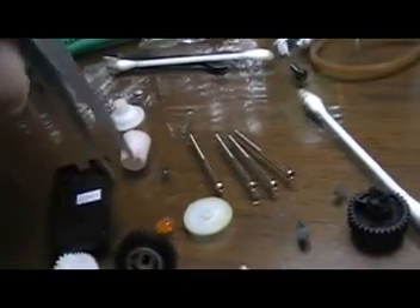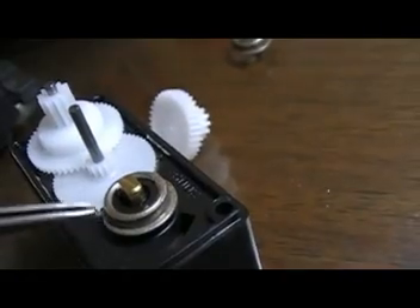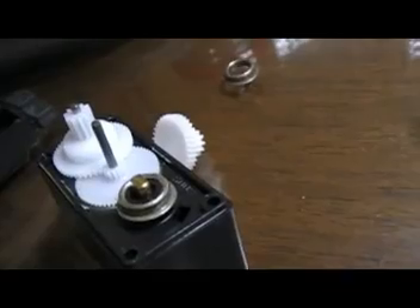Finally I was able to replace the gear. I love repairing servos — it's like repairing a watch. Make sure you put a little grease on the bushing here, and also grease here. Or better yet, you can replace the bushing with a ball bearing — you can buy one from a hobby shop using the same ball bearing size. Long ago I had been replacing all the bushings with ball bearings, that's why I have lots of old bushings here.